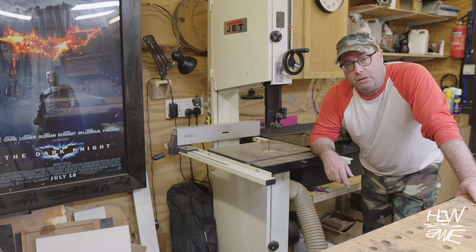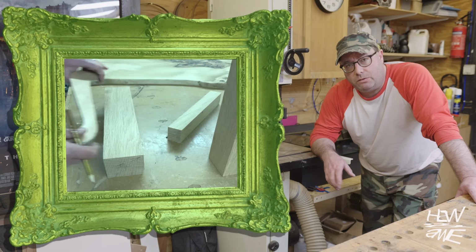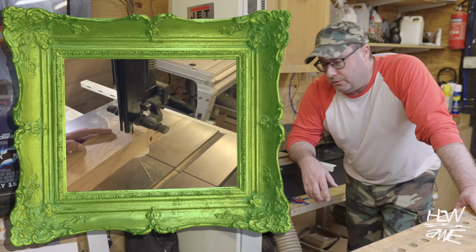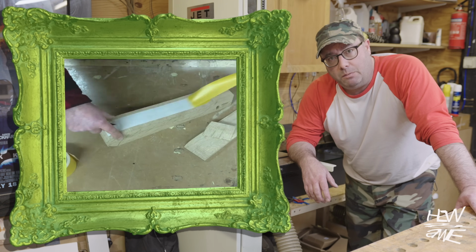I'd never buy those benchtop bandsaw things again. They're useless. They don't have the guts for hardwood. The one I tried from Axminster couldn't even cut 18mm MDF. It would stall. I'd have 4 or 5 floor-standing bandsaws, not particularly this brand, with different power, different blades, different throat capacity, and leave them all set up. I'd only have to change the blade for the same blade.